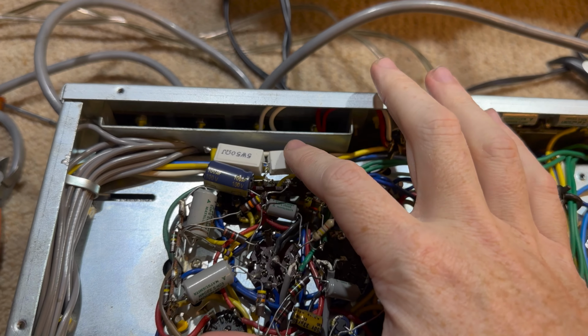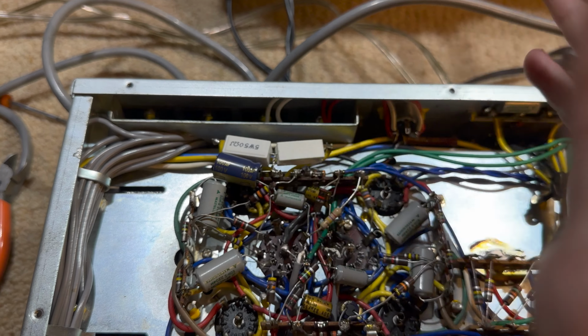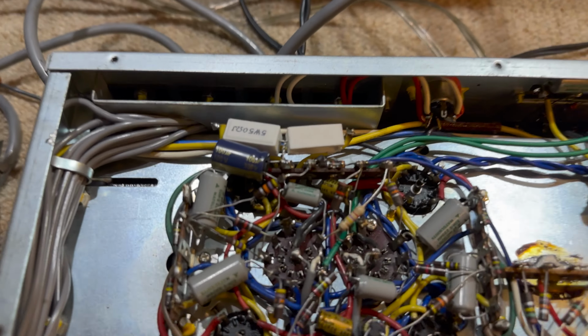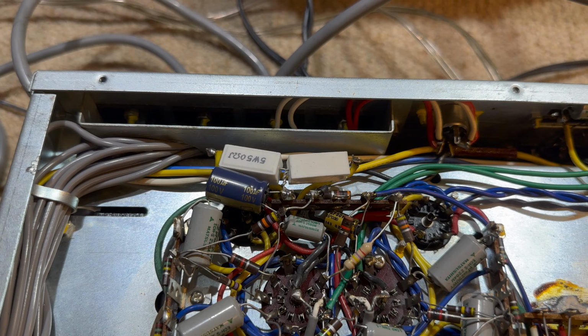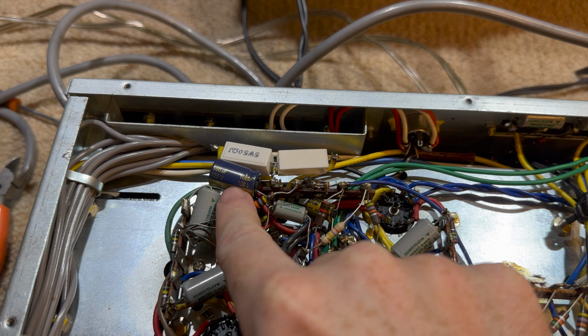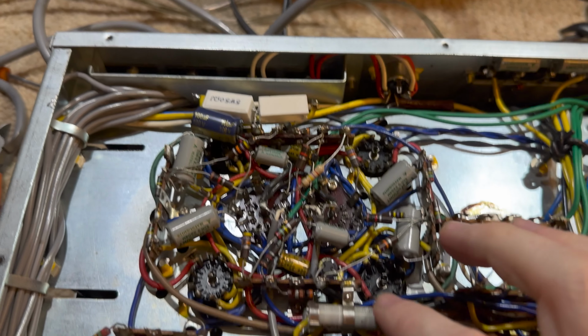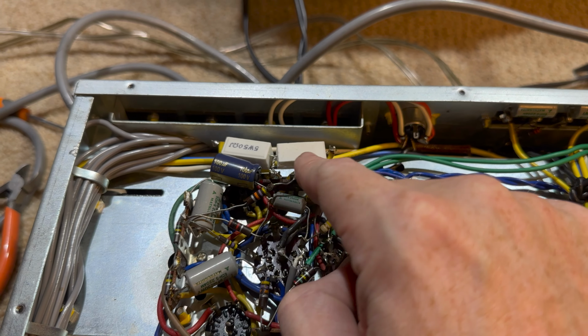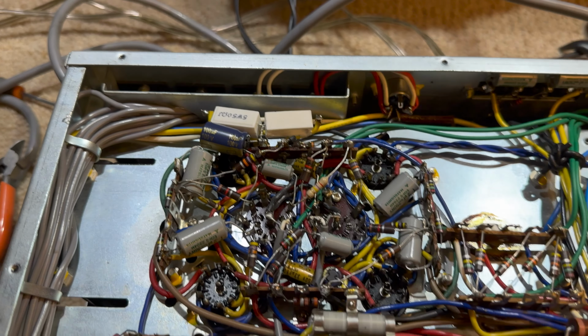leave it at that. I don't know when this was done. It could have been done decades ago. They don't look new. They look like an older style ceramic resistor. But anyway, this cap was missing from the repair. I added it back in, and that's a cathode resistor bypass capacitor, I believe.